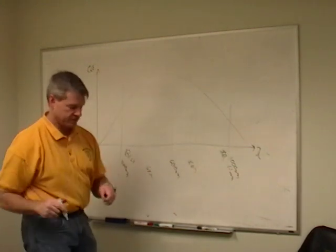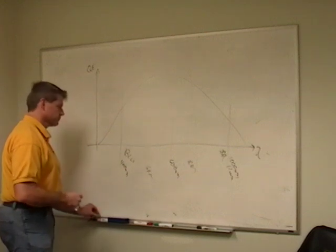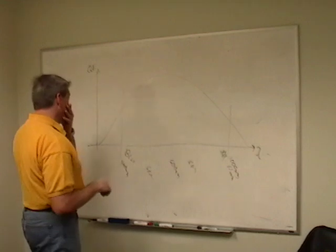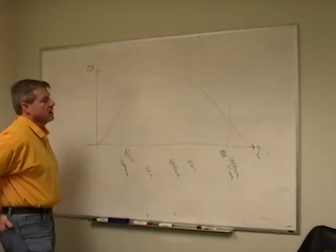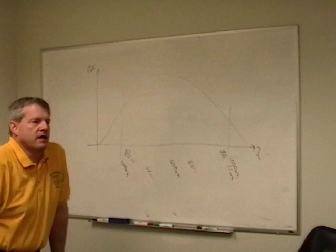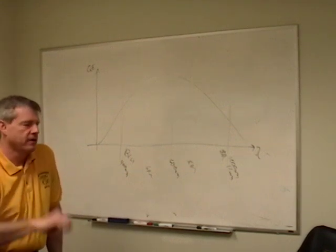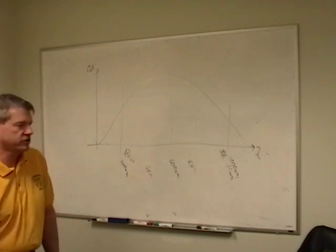Just really closely matches the human eye, so it makes silicon an excellent material for detecting visible light. It's also got a quantum efficiency, that's not the right word here, it has a photon conversion factor of 1, that is, for every photon that it detects, it creates 1 electron hole pair. So you know that when you get something off of it, you collected that many electrons.